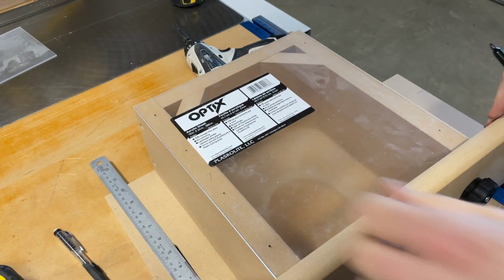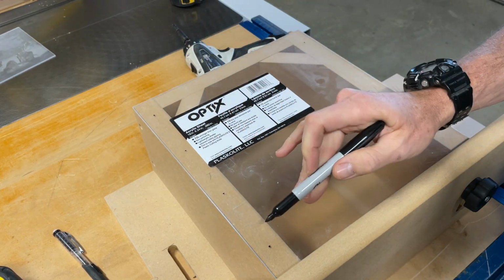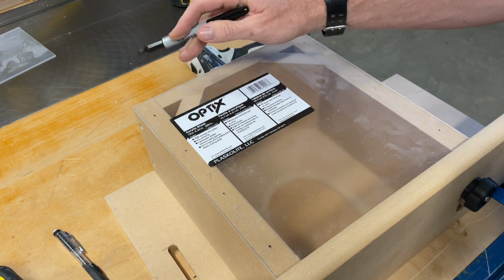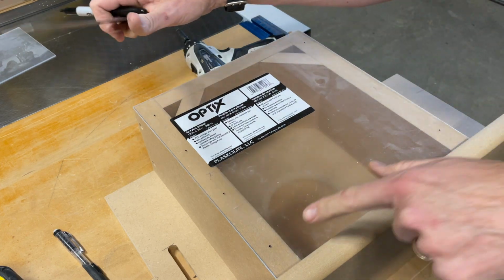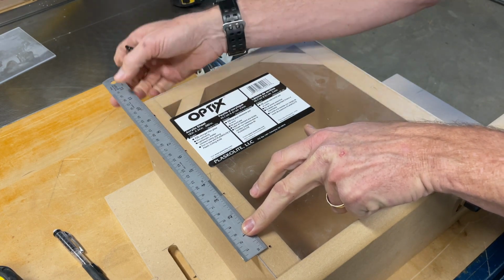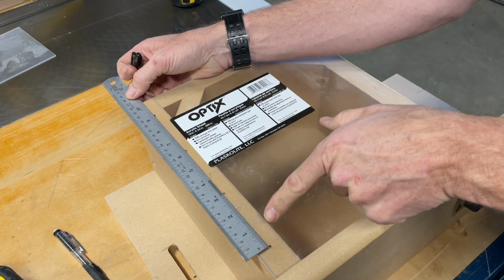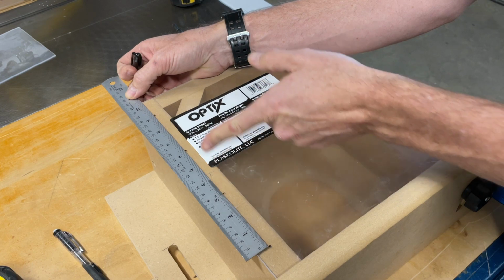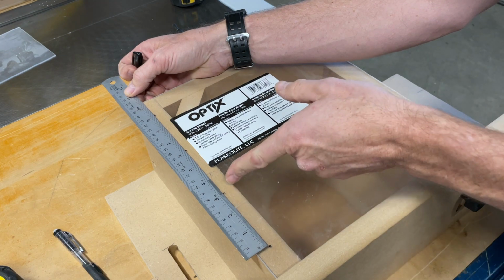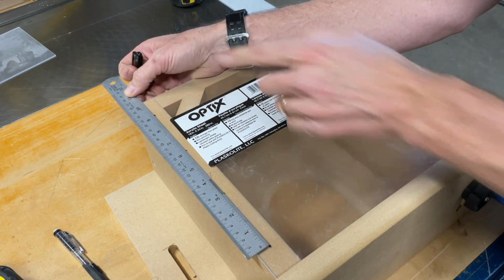Okay, this is kind of arbitrary, but I like to make these so that they're relatively evenly spaced. I came in from the front and the back 1.25 inches so it won't split out any material, just to be on the safe side. Then I took that distance and measured it out with my tape measure. That was about 9 1/8. So I figured that works out good, because if I go 3, 3, and 3, that's my spacing right there. So about 3 inches plus about 1/32. So 3 1/32, 3 1/32, and then I get to that last point